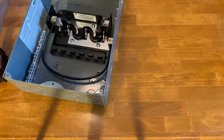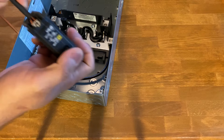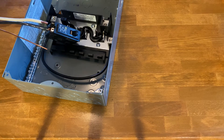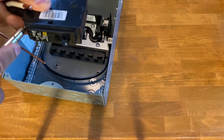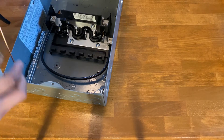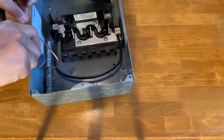This is an 8-gauge cable, which is plenty big — it's the spec the inverter requires. First I'm going to put the hot wire into the breaker and crank it down. This is just for demonstration purposes until I know exactly which hole I want. The ground connects to anywhere on this grounding bus bar — this spot looks good.